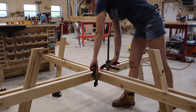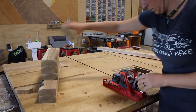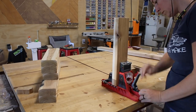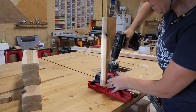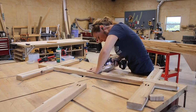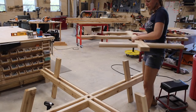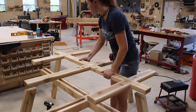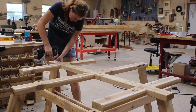It's truly crazy how much of a difference wood glue gives the final stability of a project. The base is done — let's start building a way to attach the top. I did this by cutting up a few 2x4s, then using my pocket hole jig to drill a few pocket holes and attach it all together. This support structure will not only hold the top to the base but will also hold all of the slats making up the top together. After I got all the limbs attached, I stuck it on top of the base, centered it up, then attached it using two screws per leg.